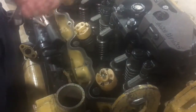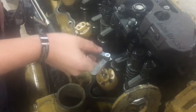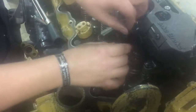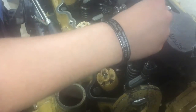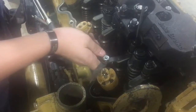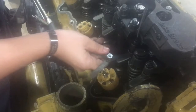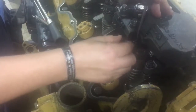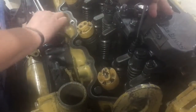We can go ahead and do that. So as you can see, it's a 25 thousandths. It's got probably about a quarter inch of clearance in there, so that ain't gonna fly. So you need to go ahead and adjust the lock nut down some. You can keep this in there, kind of give you a, all right, there you go right there. So now we're snug. It ain't tight, it ain't loose, it's snug in there. It's got a little bit of pull on it. So hold that there, go ahead and tighten that nut down. And then there you go, it's finger tight now.